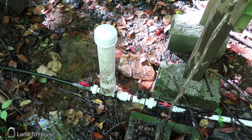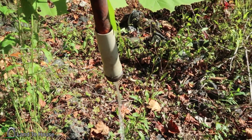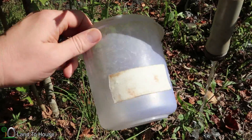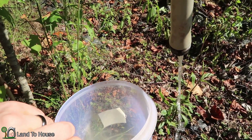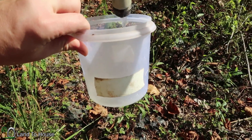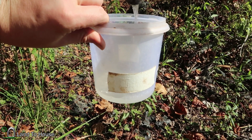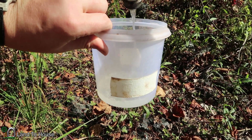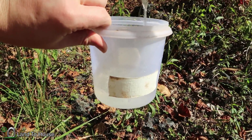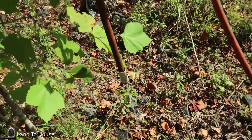I have the one-inch pump running now. Let's go up the hill and measure the output. This is the output with only the one-inch pump. I'm going to stick this bucket with tape on it under here and get the time it takes for the water to reach the line. Approximately 11 seconds is how long it took.